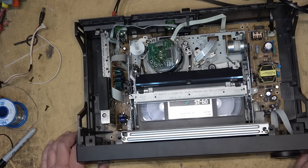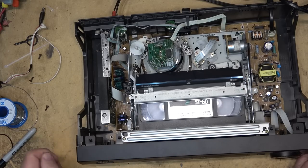There, it's working properly, as you can see. And then when it gets close to the beginning of the tape, it will slow down. That's all done so that the machine has enough time to stop before the leader runs out. So as it's getting closer to the beginning, as you'll notice, the tape speed is starting to reduce.